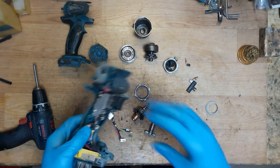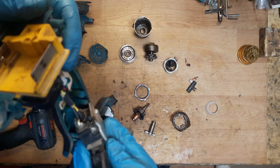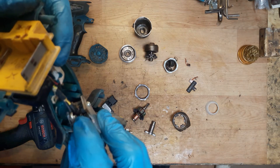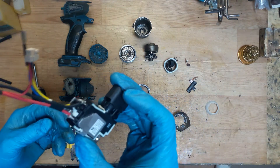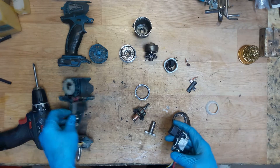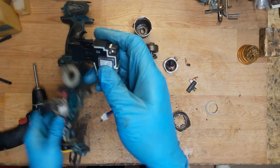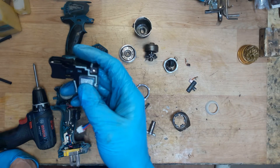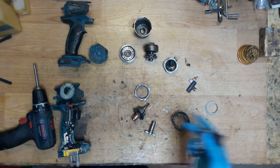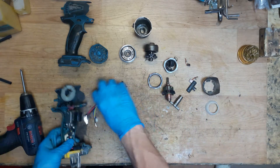The switch is burned here, as you can see - there's a mark of burning. The new switch looks nice and shiny. The part number has changed: the old part number was 6502414, now it's 6507228. They fit perfectly. I will start from the switch.